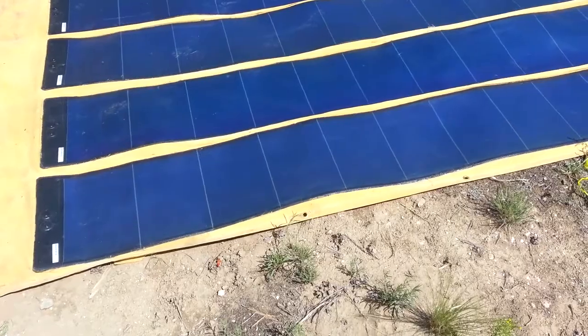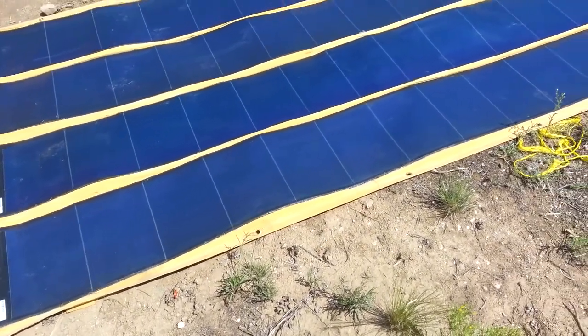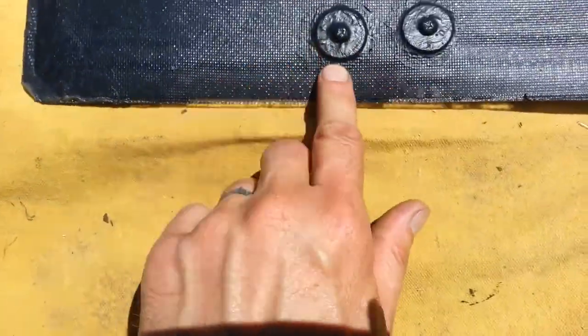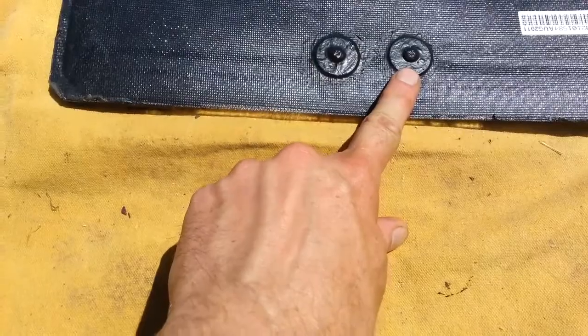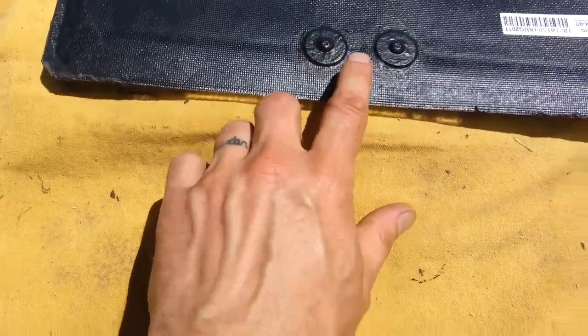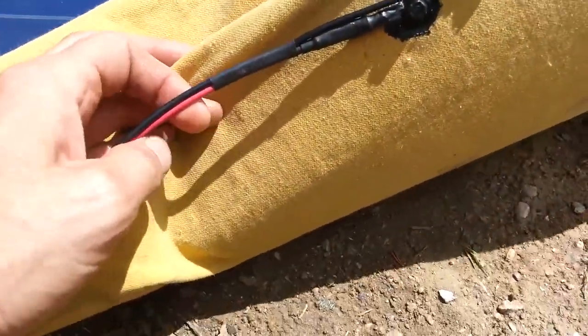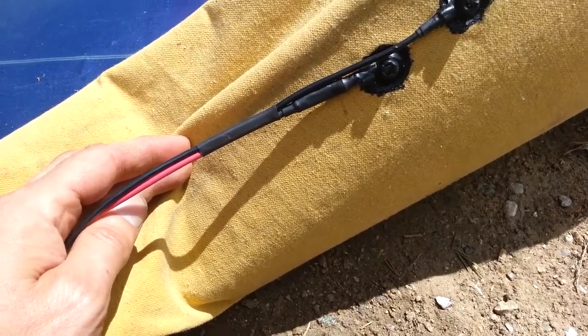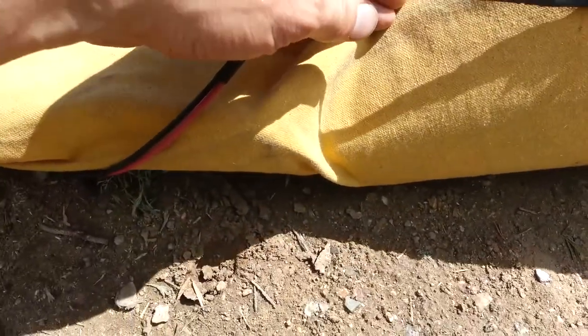They seem amazing — you can shade any part of them and they'll still put out power for whatever part is not being shaded. They did not have wires attached to them. I cleaned away the contacts and used a combination of washers, liquid electrical tape, and a bolt down through to connect the wire leads. I probably would have done 12 gauge wire if I were buying something, but I had 14 gauge and it's a pretty short stretch.